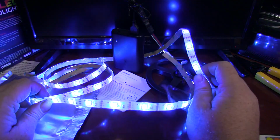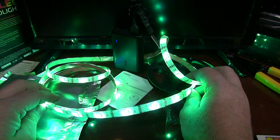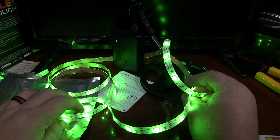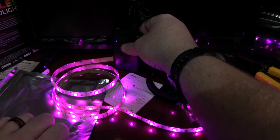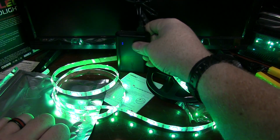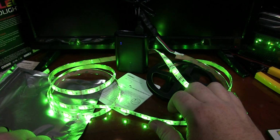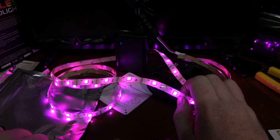And again, if you want to find it on your own, your local Walmart near the electronics section. These will just be great for those handheld props or outdoor haunts where you need a prop in a location you just can't run power to. And just USB battery packs. Just make sure they support at least an amp output. I would try to go for 2 amps, so basically a tablet charger. But USB, LED, there you go.